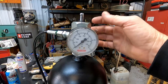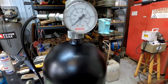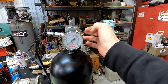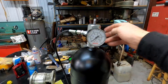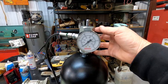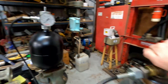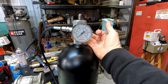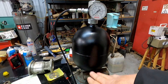That's empty. Close the bleed valve, crack open the bottle to put a little nitrogen in, then open the purge valve again. I do that two or three times to make sure there's no static air left — I want pure dry nitrogen in the accumulator. Just a little crack and close it — that's enough to fill the chamber and push the diaphragm down, and when I open the bleed valve the diaphragm pushes it back out.